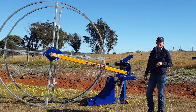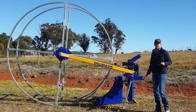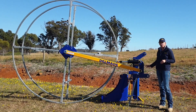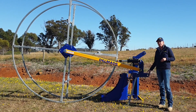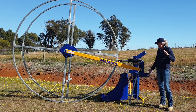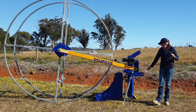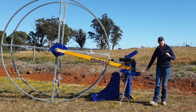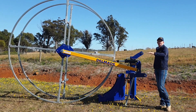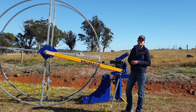One other thing to consider when choosing the right option for you is that you're going to have enough ground clearance underneath your three-point linkage. Even when you've got this unit fully lifted on your three-point linkage arms, you still need to make sure that there's enough clearance between the ground and the tine so that you're not going to be touching the ground as you're driving along.